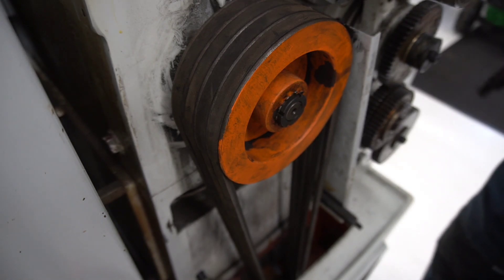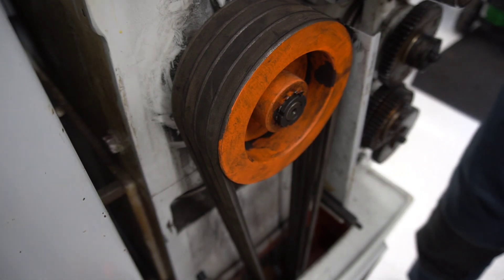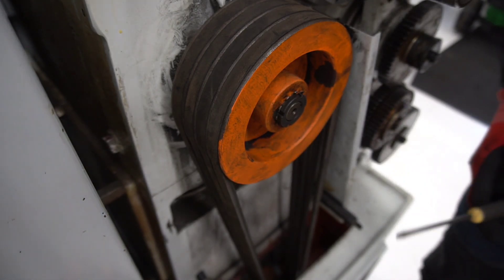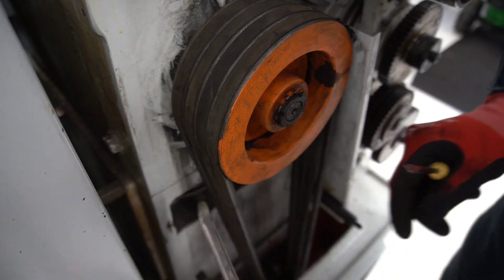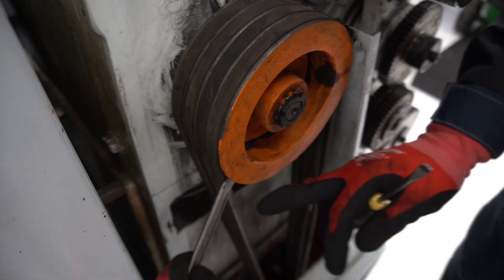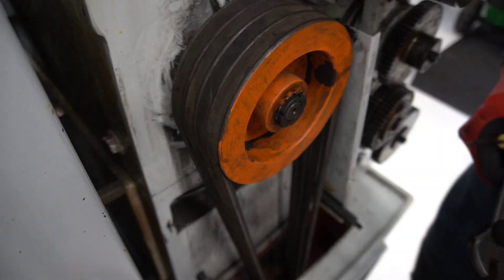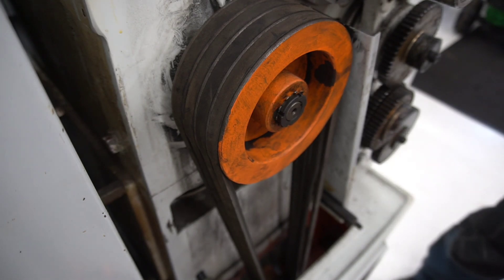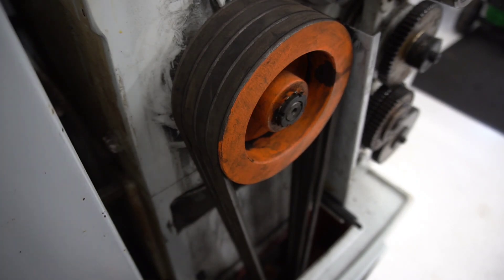That was what I have to say about putting belts on a belt pulley where the motor hasn't been released from its tension. Of course you can do this in other ways, but it's the way I do it. If you have a bit more space, a regular screwdriver is good, or else some sort of small pry bar that you can get between the belt and the next groove, and then push it further along. I hope you can get some help out of this. Thank you for watching. Have a nice day. Bye bye.